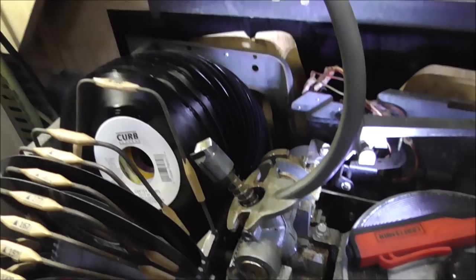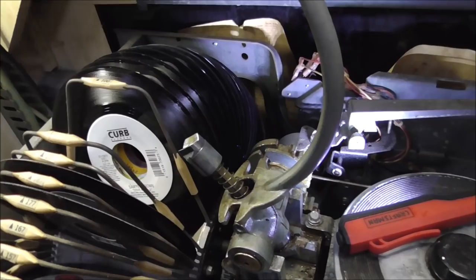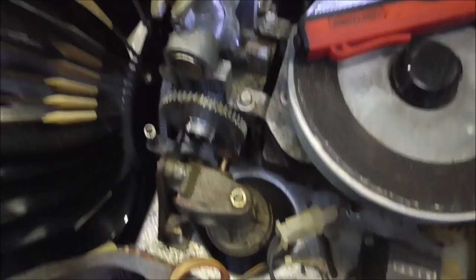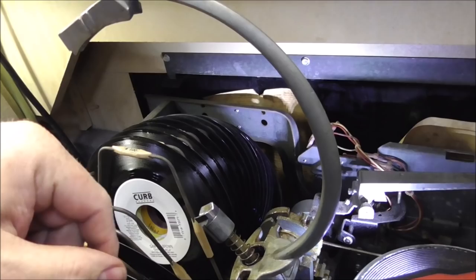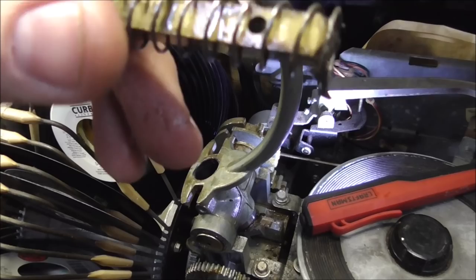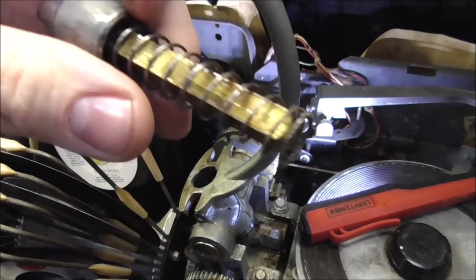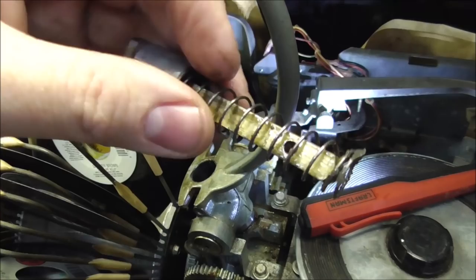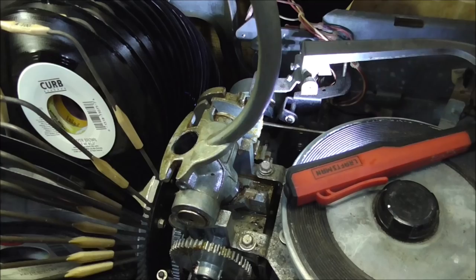Okay, now depending on how stuck yours is up inside where the piston goes and where the spring is, whenever you do that, some of that's going to come apart. If it does not come apart, you may have to raise it up in the air a little bit, like I did here, by turning the knob on the bottom of the motor, so that you're no longer going to interfere with the basket, right? But eventually, now that that cotter pin is out of the back, this entire piston is going to come out. You can see the hole where the pin was going through it. You can also see that there's all kinds of nastiness all over this. That's what's gumming everything up. That's the oil that you've put on it, or if you choose to do this first without putting any oil on it, it'll be all of the dried up, greasy crap that they put on it at the factory, or the WD-40 that somebody has sprayed on it.